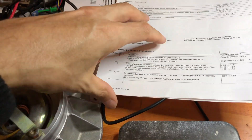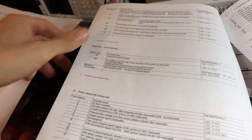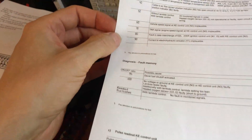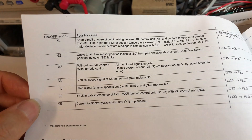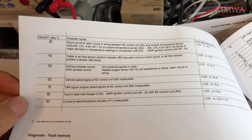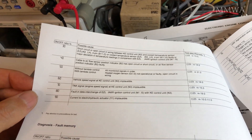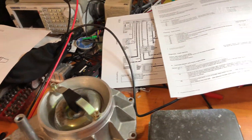If you look further into the diagnostics manual, 80% with the engine running means missing data exchange with the EZL. I'm not sure if that's applicable, but the EZL is not here anyway so there is no serial data communication occurring — so it could well be it.